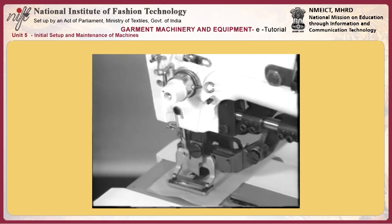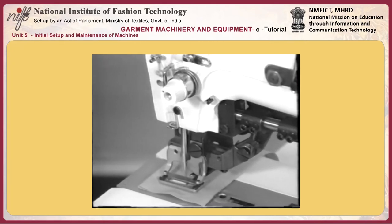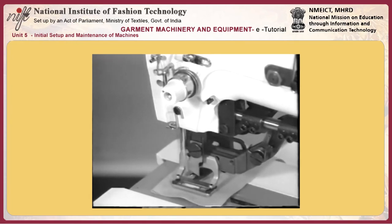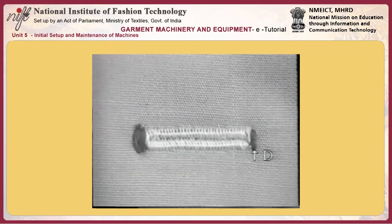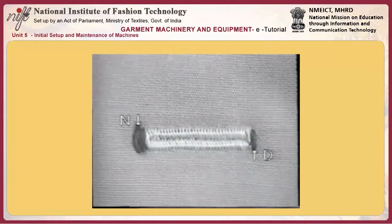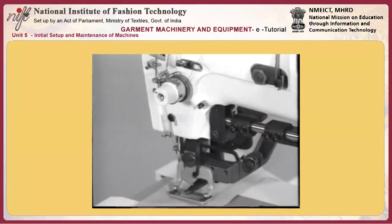30. Adjusting bobbin picker unit A. The bobbin picker unit is connected to the bobbin thread trimmer unit. The bobbin picker unit not only presses the bobbin from rear position B of the hook when the bobbin thread puller holds the bobbin thread to prevent the bobbin from idling, but draws the remaining thread down under the wrong side of the material. It also works to secure the required amount of the bobbin thread to prevent stitch skipping or thread slip off at the start of sewing.